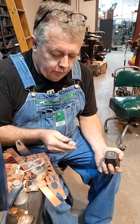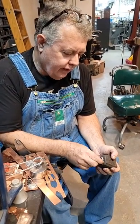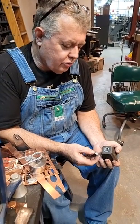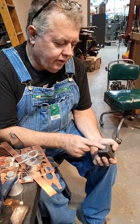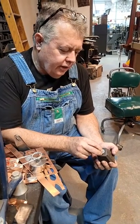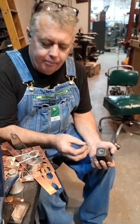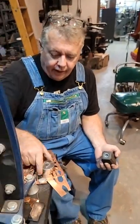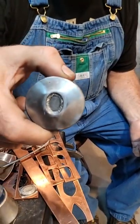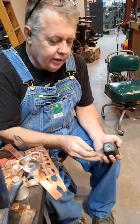And when you go to press it, it's going to shrink because basically your metal is now the exact same size. So normally what you'd want to do, you could lay a piece of thin copper in there to give you clearance so that when you drive your force into it, it will give you the clearance for the metal. Having an exact shape isn't a big deal on this die, not critical at all. But something like this, you'd need to compensate for the metal.